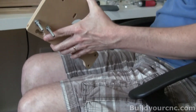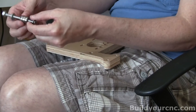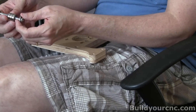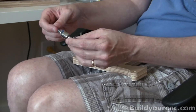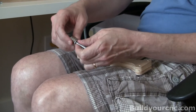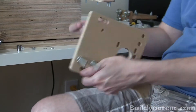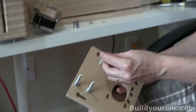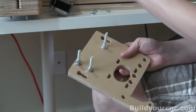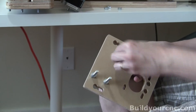We have a three inch screw with two washers — one big and one small. We're going to have three quarter-inch inside diameter bearings, then another small washer and then a larger washer. The smaller washer is just to keep the bearings in motion; these washers will conflict with the outer races, so you want to make sure those smaller washers are in there. Put the last screw into this hole and put on a washer — a thin washer — then add all three bearings with a quarter inch bore, a thin washer, and then a large washer.